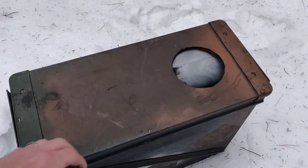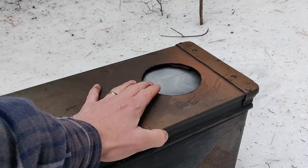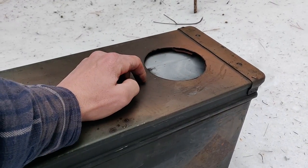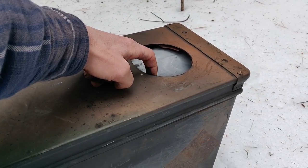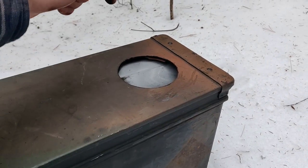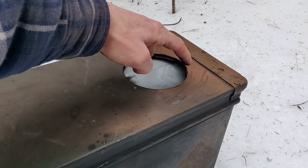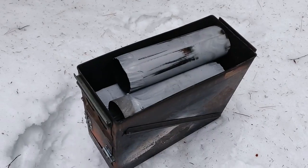Starting with the top — this here is a four-inch hole. I just used a hot chocolate container, put that down, traced around it with a permanent marker, and then on the inside of the circle I drilled a hole through. That's when I put the jigsaw in, using a standard metal blade, and just followed the inside of the circle and cut through the steel pretty good.